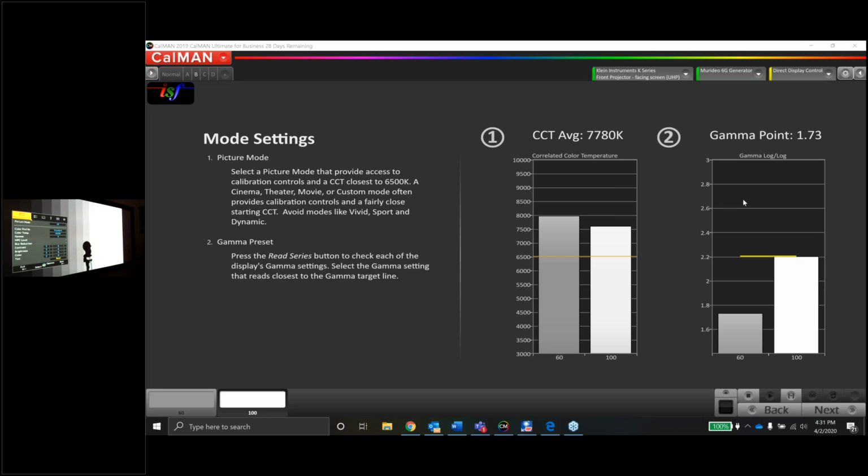A couple things that I could tell you that would probably help you out with some stuff that I've seen so far. So go to where it says color profile. Yes. And what you were doing before is you were just kind of cycling by pushing right and left, and it takes a long time for each thing. So hit the OK button on your JVC. Yeah, don't cycle. Just push the OK button instead. Okay. Boom. And OK. Ah, there's the CMS. Now hit it one more time. Perfect. And this works with any of the gamma or anything. Then it gives you all the choices, so you're not sitting there stepping through each one.